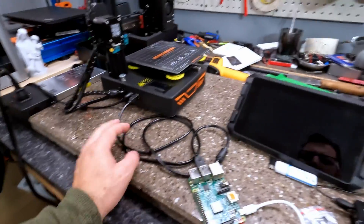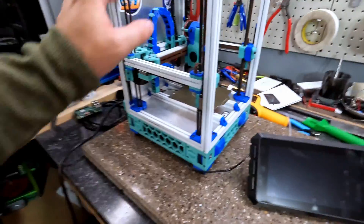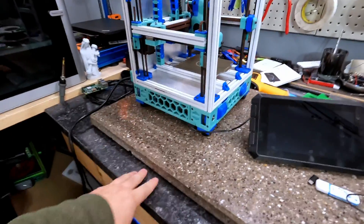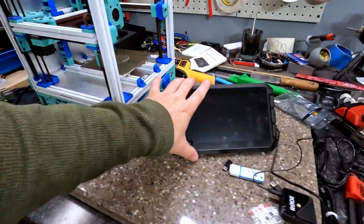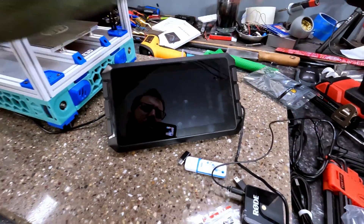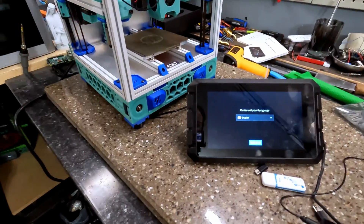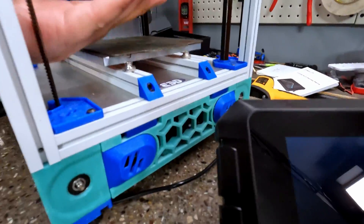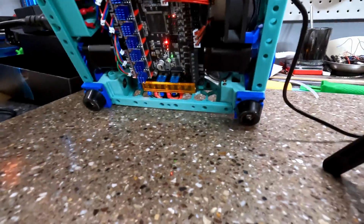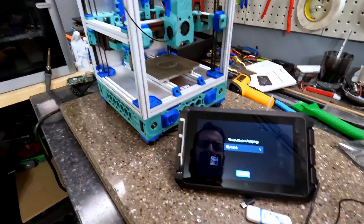It's not the printer and it's not the Raspberry Pi, so let's plug the Sonic Pad into another printer that has Klipper installed. This is my Micron printer with a BigTreeTech Octopus board — the KP3S has an MKS Robin. Connected it to the Creality Sonic Pad via USB, powered everything up, and nothing — nozzle's cold. We can also flip the printer over and see the heater indicator light is not on. Most controller boards have a light that illuminates when heaters are active, so we're good here.